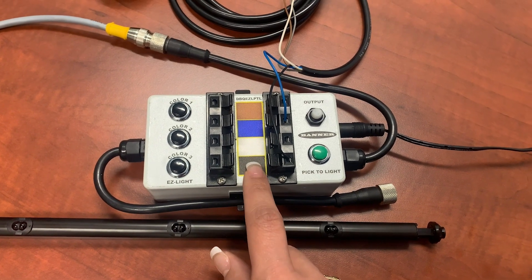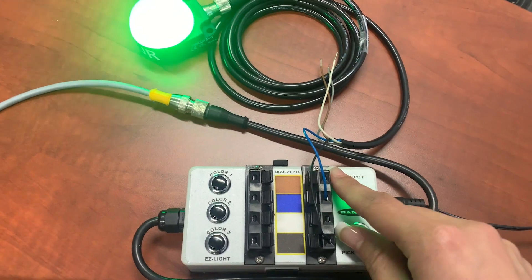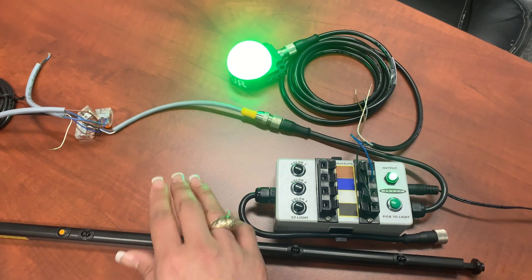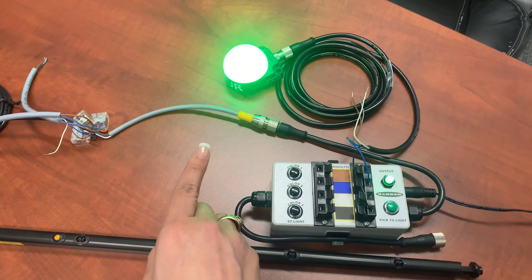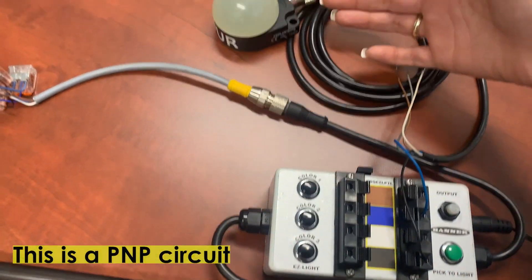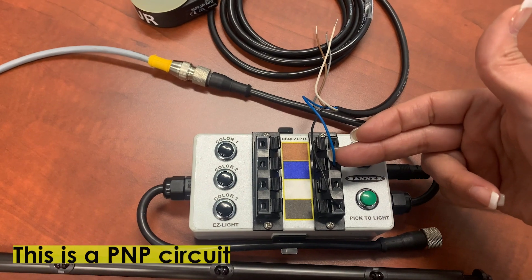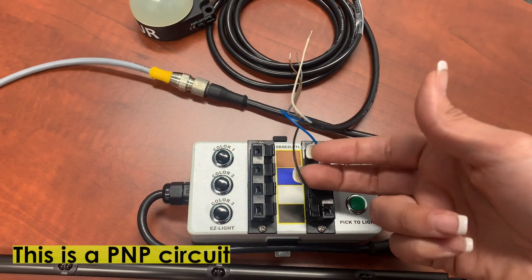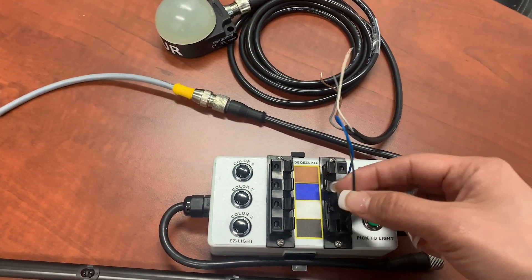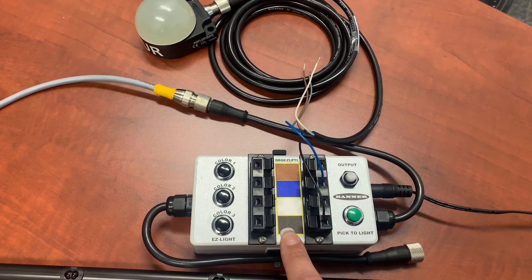That TTR sensor activates the black wire and turns on the light. I used the black wire, which is the black wire on the K30 — so that happens to be the green light. But you can use any of the other wires; you just have to make sure your blue terminal is connected to ground, and that works. Hope this was helpful for using these very handy battery boxes out in the field. I'll see you on the next video.